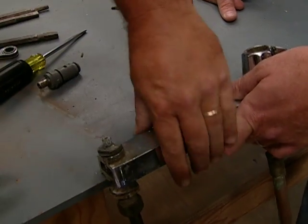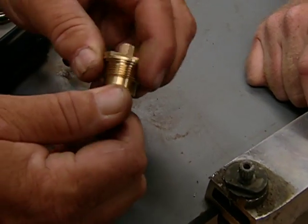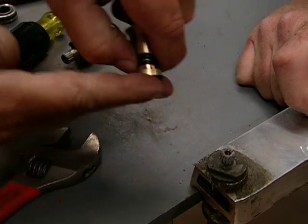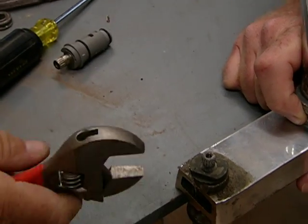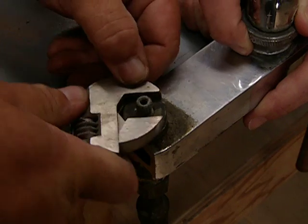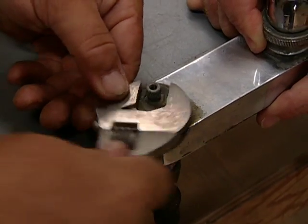But this is a traditional faucet that has a stem unit that looks like this. So this is going to be 20 years or older. Absolutely. This unit has a washer at the bottom, and as it shuts the water off, it pushes against the seat at the bottom. Yeah. So now we're going to excavate to the next level. So this is likely where we're going to have our problem. That was pretty loose. Okay.